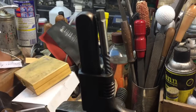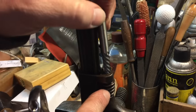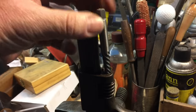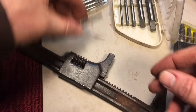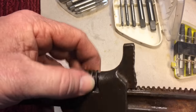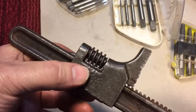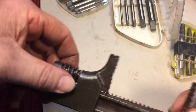After seating this down here, we can see one thing for sure: this pin is rusted to the thumb wheel. So there's only one thing we can do — we have to go to the last and final resort. We tried this and it didn't work, no problem, we just go to the next step. The pin is spinning with it, rusted to the actual thumb wheel, so no matter how much I turn on that it's free spinning but rusted to the side. The only thing we can do now is take a Dremel cutoff wheel and go in between that little gap on each side.